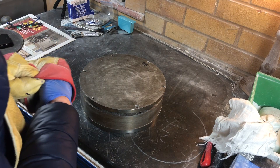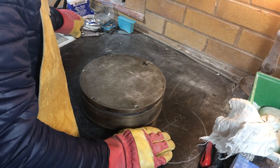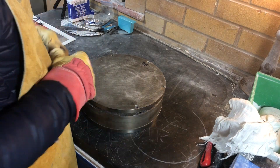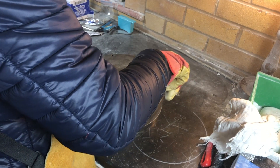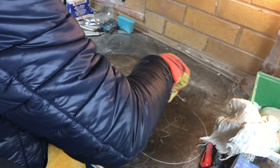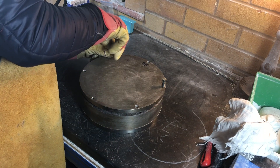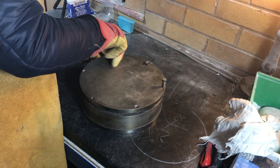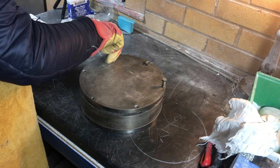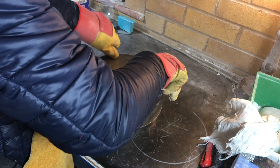Hello again. It's been five and a half to six hours since this went into the vulcanizer, and it's been allowed to cool down a little so it drops to about 65 to 70 degrees centigrade. I'm now going to screw the bolts into the appropriate holes to take the top of the mold can off and get to the vulcanized rubber mold inside.